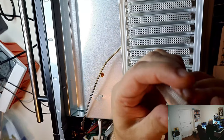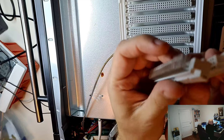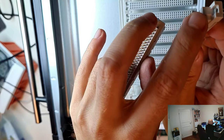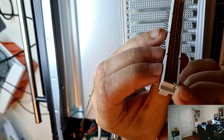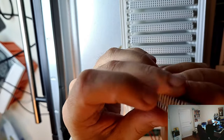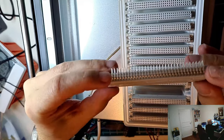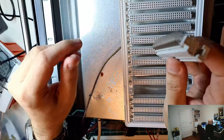Those connectors will pass everything — ground, power, all the signals, and so on. I will have several of them on the backplane, and each connector on the PCB corresponds to a single module, like ALU, stack, or whatever. Those modules will be half euro card standard, so pretty small, and they will be arranged vertically as a tower of modules.